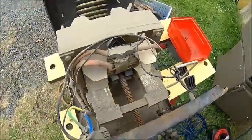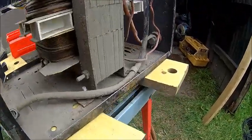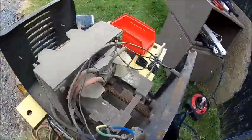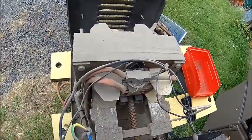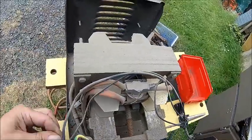I'm surprised — apart from an awful lot of dust, the transformer looks okay. No burnt windings, it's just dusty. The spindle needs a bit of oil because it's hard to move, and we obviously need to blow the dust out. There's some corrosion on the switch here — we'll see if it works or not.